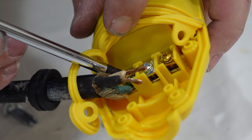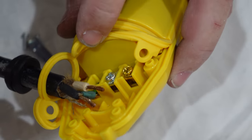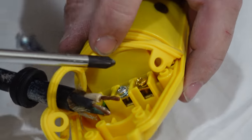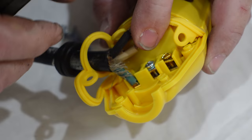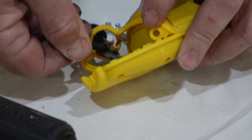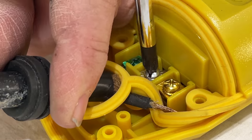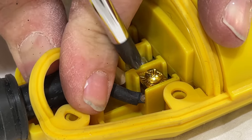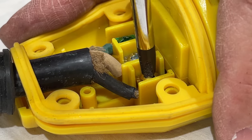We've got three screws here. Obviously, the green wire goes under the green screw, the white neutral is on the silver screw, and our black wire is on the gold screw — just like a receptacle. You do not wrap the wire around the screw. See that square plate just under the screw head? That is a clamping plate. The wire goes in where I'm pointing with the screwdriver, and as you tighten the screw, the wire gets clamped. It's a very strong connection. The worst part is getting all these wires in here with so little room to work.